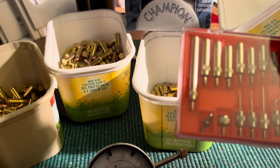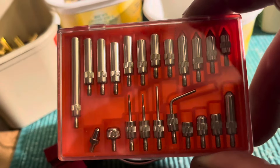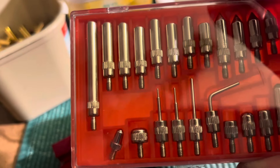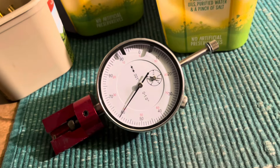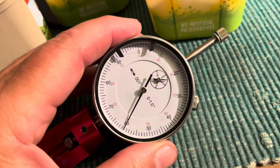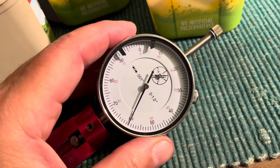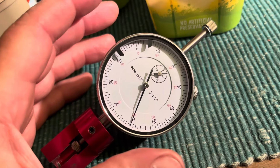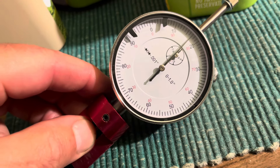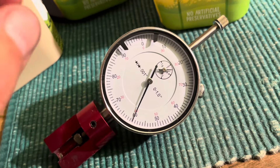You can pick up these tips and this gauge on Amazon - the tips were cheap, I think under 10 bucks for the whole kit. I couldn't find just the one I wanted individually; the singles were eight to ten bucks each, so a whole kit for ten bucks was a deal. The gauge - there are digital ones for around 25 bucks, and some up to 300, but you don't need that. This one was about 18 bucks and arrived in two days. It's probably not as accurate as the one from my last video, which was a couple hundred dollars, but it's rated plus or minus one thousandth, which is good enough - we're just checking consistency, not absolute thickness.